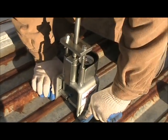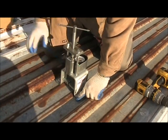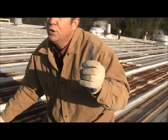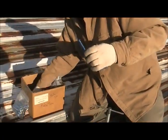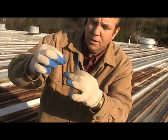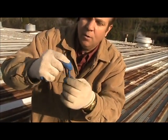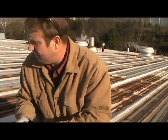So that's your pull-out value for this particular screw. These screws are available in a number 15, which is a large diameter — that's what you want to use so you get maximum pull-out value. You can see the difference in diameter; this smaller screw has a lot less pull-out value. The wider the diameter, the better the pull-out value.